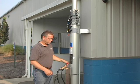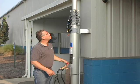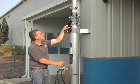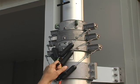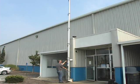Exhaust all air from the mast to confirm the section is locked. If the section retracts, repeat this step. Follow the same procedure for each subsequent mast section, going from smallest to largest. Watch carefully that the T-handles do not become entangled or snag on anything as each mast section is extending.